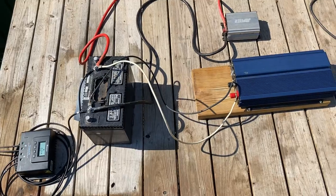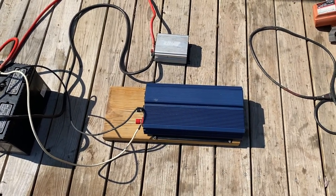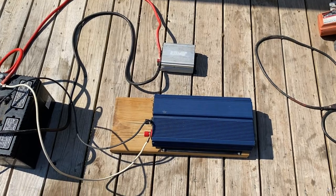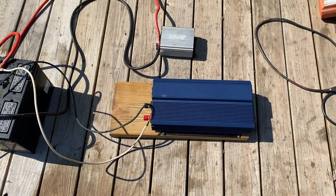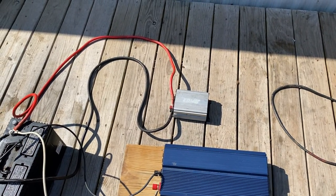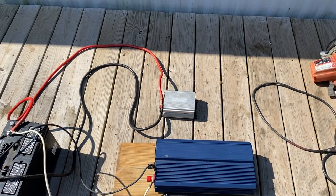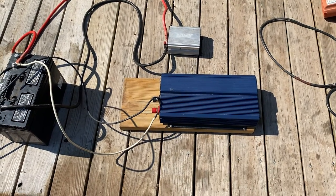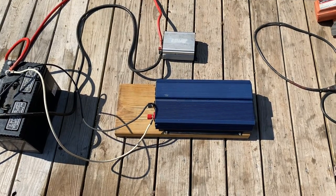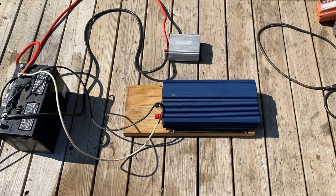Then we hooked it up to the batteries — we got two of these coming out. Now, don't overpower your power inverters. The silver one is 1000 watts continuous and the blue one is 2000 watts continuous. If you want to run a refrigerator, lights, something like that, running low volume, I would run the little one. The reason why is I ran the vacuum cleaner on both of these — the little one ran for about two hours and thirty minutes, the big one with the same vacuum cleaner and same battery at full charge ran for a total of 45 minutes and ran it down. Now this fan does run all the time on this thing, so that is another thing to consider.